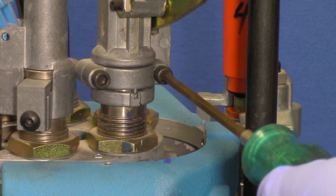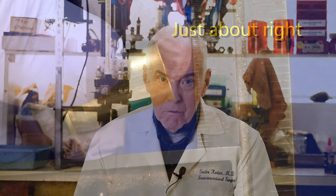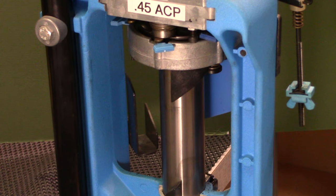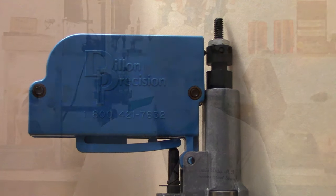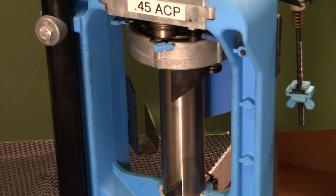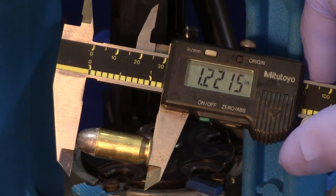This is a really important adjustment, and it's best to confirm the flaring adjustment is absolutely perfect before you put the primers and powder in the system. Another return of the handle moves the case to the powder check station — a downward pull should sound the alarm because you have no powder in the cartridge case. Another cycle places the cartridge under the bullet seating die. Seat a bullet with another handle pull, take the cartridge out, and measure it to be certain that the overall length is correct.